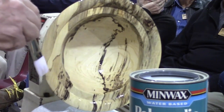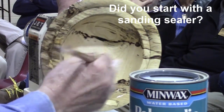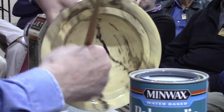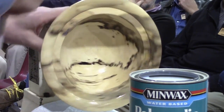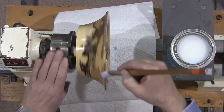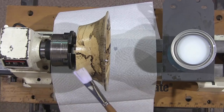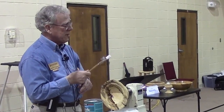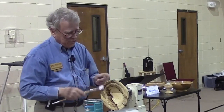So there it is — the first coat is already drying. In two hours you can sand it and put on the second coat, but if you let it set overnight it's a little harder. Sand with 320. Another secret: I buff nearly all my finishes between coats — with Tripoli, as Bob was talking about. Do not use steel wool.